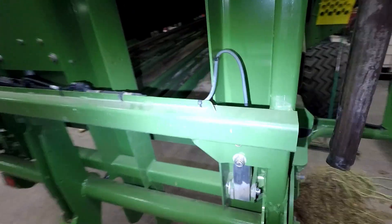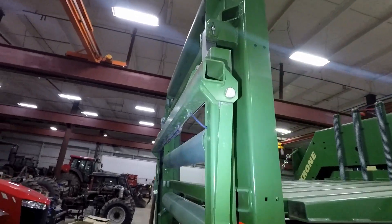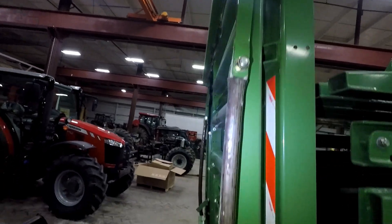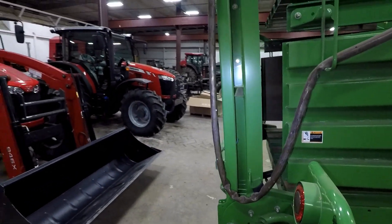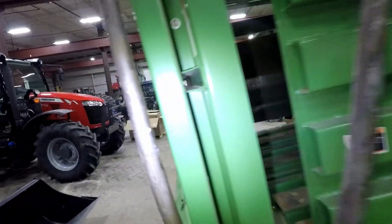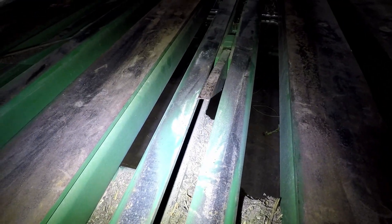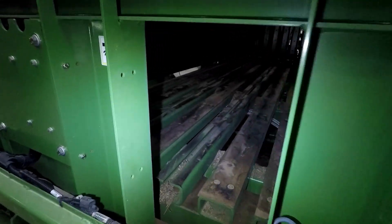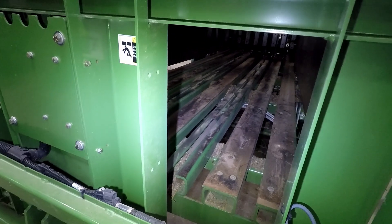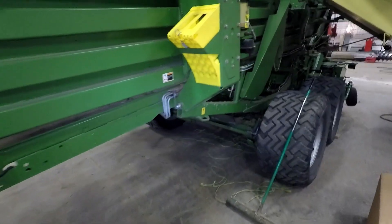This one's actually got load cells right here. So when this bale rack is actually folded down, we have a load cell right up there as well. So when that's folded down, we actually get a true weight as that bale's falling out of the baler, which is kind of cool. The other thing that this one's got — see that little arm right there — is going to actually retract. That is a bale ejection system. So when you get done with a field and you're going down the road, you don't want a bale to fall out. You can actually kick that bale out before you move to the next field or at the end of the season.